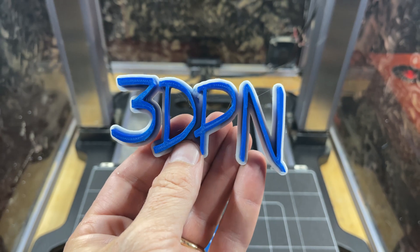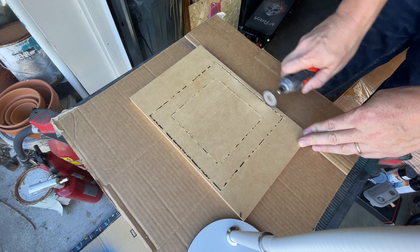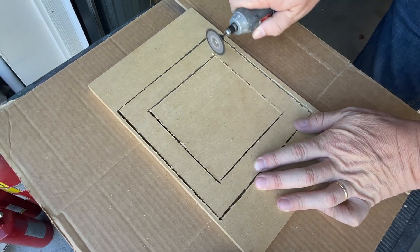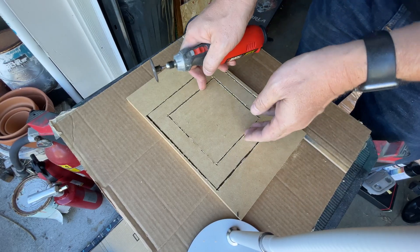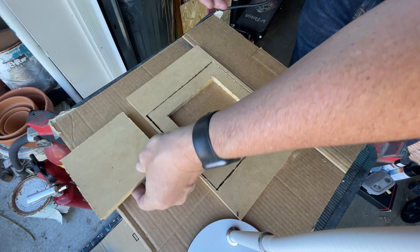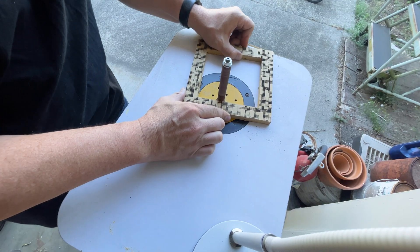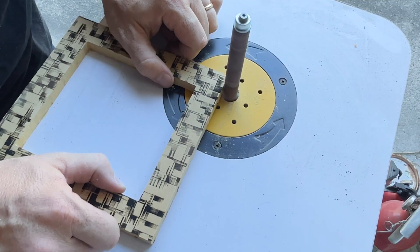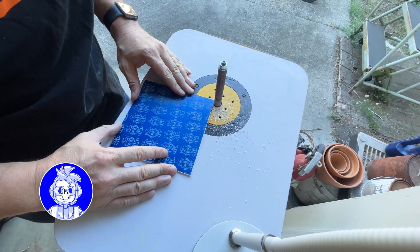I've got all the parts now — it's time. I utilized a little Dremel with a cutting disc and cut out the pieces from their tabs. The outer frame tabs and the tiled Joelbot tabs were cut out. Then I brought out an oscillating spindle sander to sand the inner and outer parts of the frame and the outer parts of the tiled Joelbot. Once I had all the pieces finished up, I took it to my office, added some super glue, and turned this idea into this.